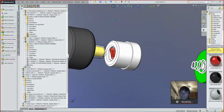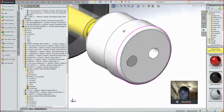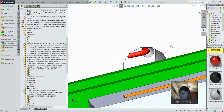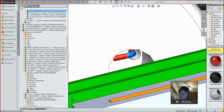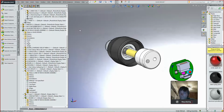Right, so the coil is down at the bottom of here, and we're going to pick up these aluminum plugs that we're going to bang into the bottom of the ceramic there, and you can see our coil leg comes right out right there. Little red line there down in the bottom. So we're going to bend it over, and then we're going to pound this aluminum plug in the bottom, and then our flex circuit is going to butt up against that stuff.